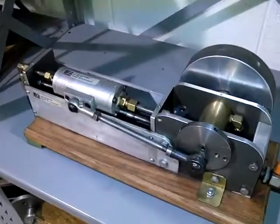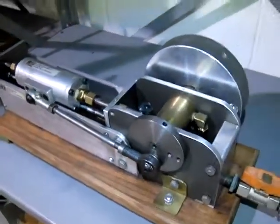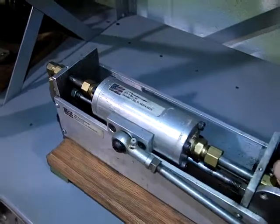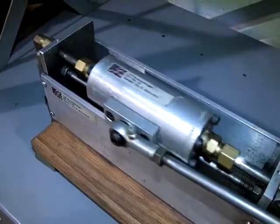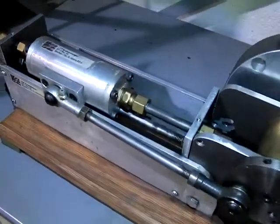This is a single cylinder double-acting pneumatic engine built by Clifford Brandenburger. Everything is homemade, like most of his engines — even the cylinder is cast aluminum. He called this the inside-out engine because the piston is stationary in the center and the cylinder is what reciprocates around it.